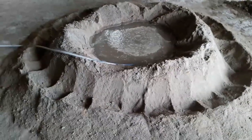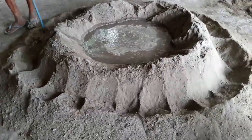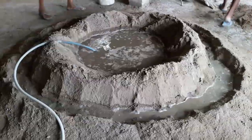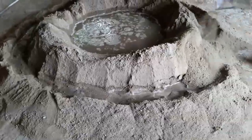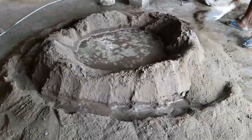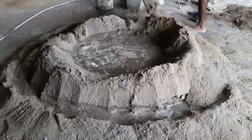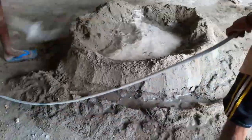If needed, you can create 2 craters — one in the middle and another at the edges. We need to add more water relative to the amount used in a floor screed mixture. The water will begin to sink and soak through the mix. Then with the shovel, pick the dry mix from the edges and throw it into the water in the center, as you can see in this video.